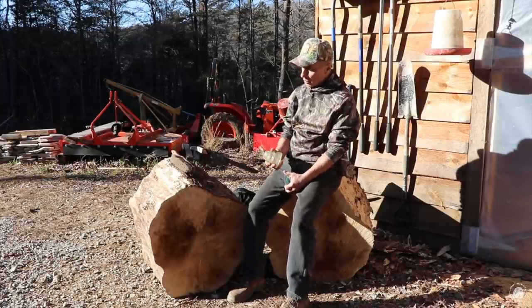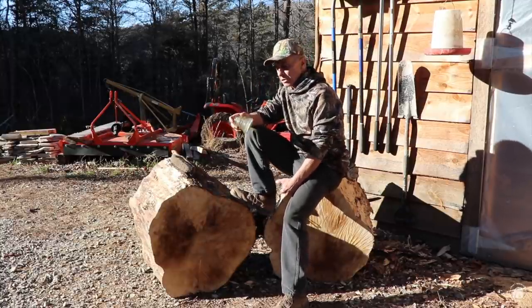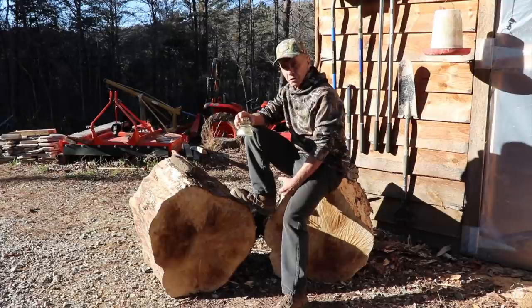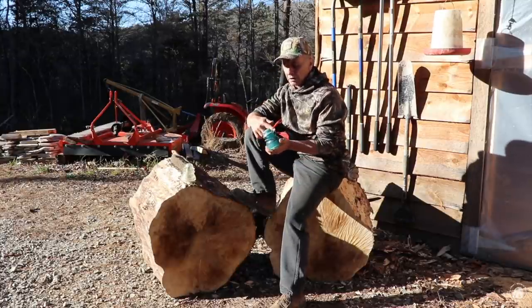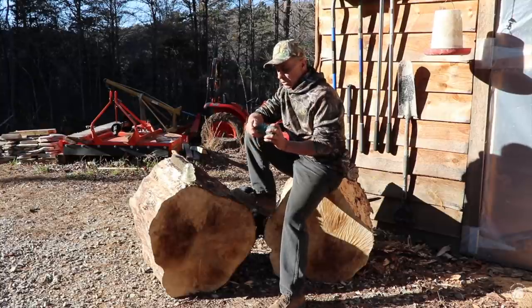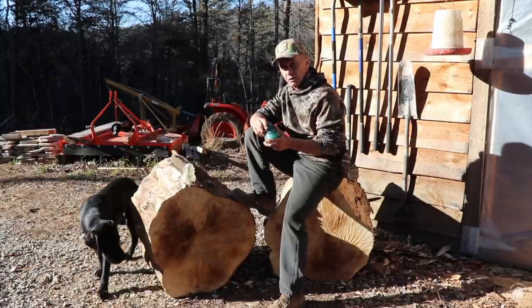But what I was going to say was, back in the day when they first came out with the telephones, they used these on the actual telephone pole because they weren't joint use at that time. And they supported what we used to call open wire, which is basically a single strand of wire that was heavy duty, and it would go in here and that would keep it from grounding out on the pole. The only thing was, when we had ice storms and stuff like that, the ice would melt, coat that, it would run, it would freeze, and it would still ground itself out to the pole.